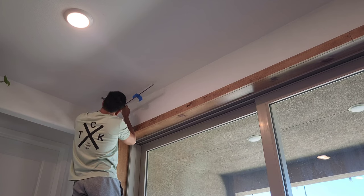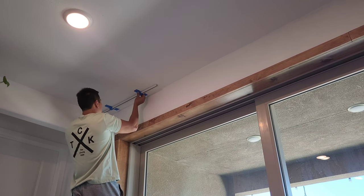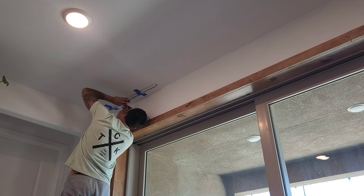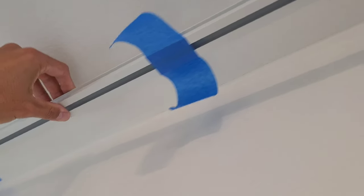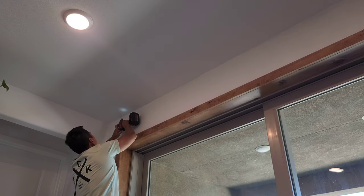These tracks are aluminum and extremely lightweight. I'm using painter's tape to hold this up, and my combination square to make sure several different points are all equal at three inches. Then I'm taking a drill bit that fits the exact size of each mounting hole to make a little mark so I know where to drill. I went ahead and used my stud finder just to make sure there are no studs in the way. If there are any studs, I'll just drive the screw instead of using the anchors.